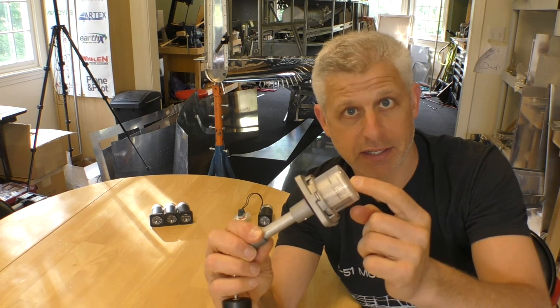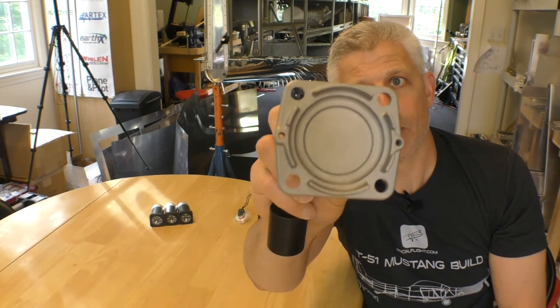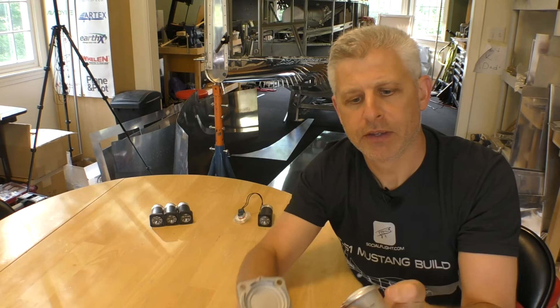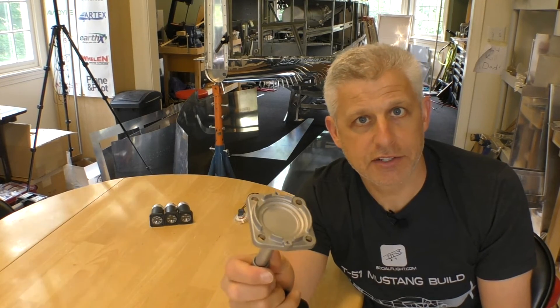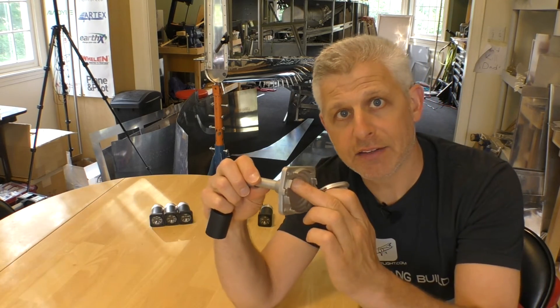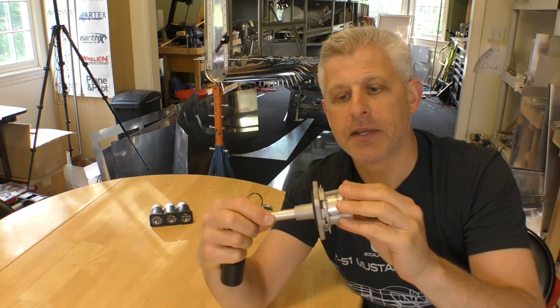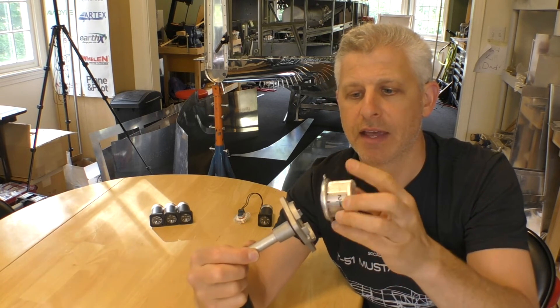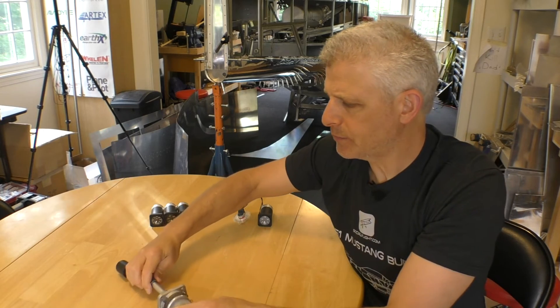The answer is absolutely not, and I'll show you right now — you take this off and there's nothing there. All this is is a cast piece. So how does the movement of this shaft and float translate into the movement of a drum inside? The answer is it's done through magnets. This is an entirely sealed unit — there's nothing available to the cockpit that would leak fuel into this drum. You have this flat surface, and beneath it is a rotating magnet, and inside the drum is a corresponding piece of metal or magnet. As you put this into place, the two meet and the drum moves.